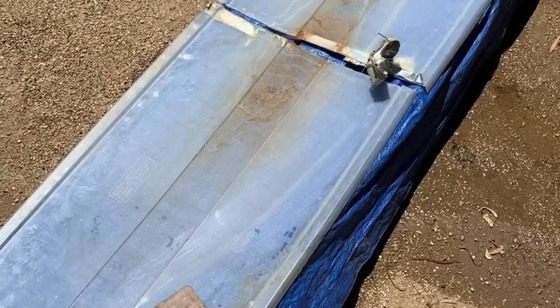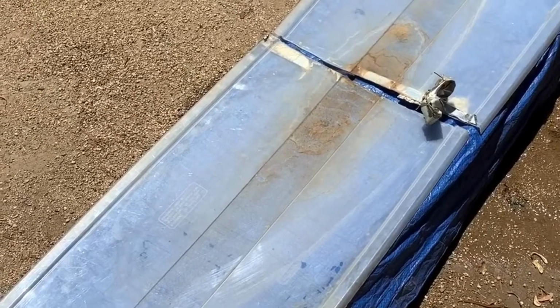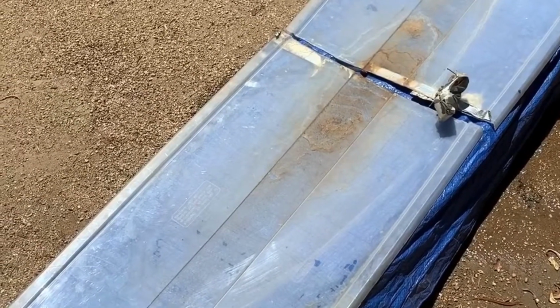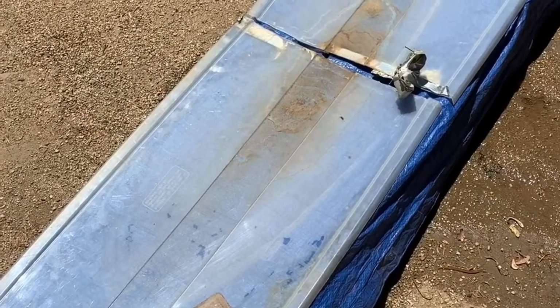You leave it in there for about a day. After a day, they'll be fully saturated and ready for the bending process. I wouldn't leave them in there for any more than 2 days for fear of them starting to get moldy or perhaps decomposing the wood itself.